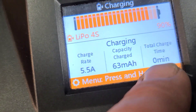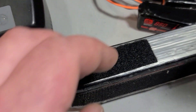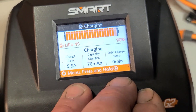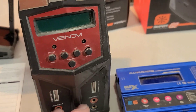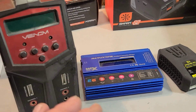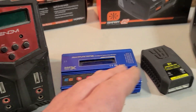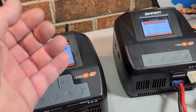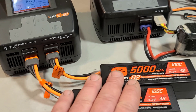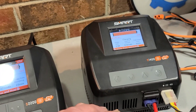One thing to note: with the smart batteries the total charge time and remaining time display properly — you can see 29 minutes left — but with a common battery it does not tell you how much charge time is remaining, so you have to estimate. I've had batteries catch fire and cells go bad with other chargers, and I think it's because they weren't getting a proper deep full charge per cell. Charger selection matters — the technology and power going into your LiPos for a deep, full charge per cell really does matter.